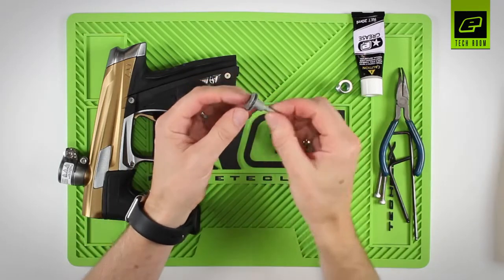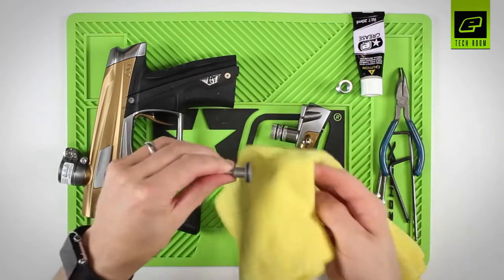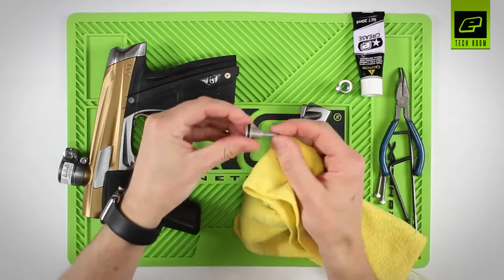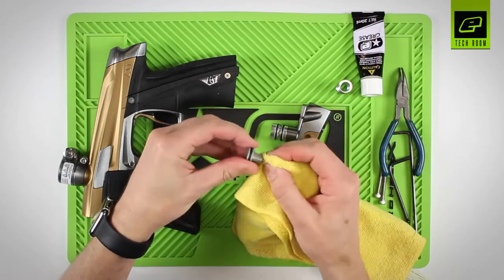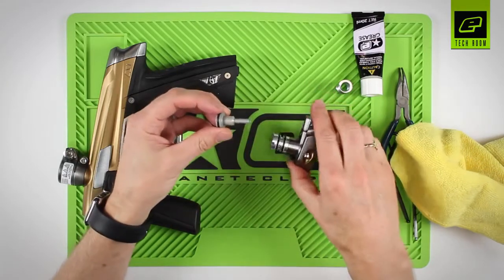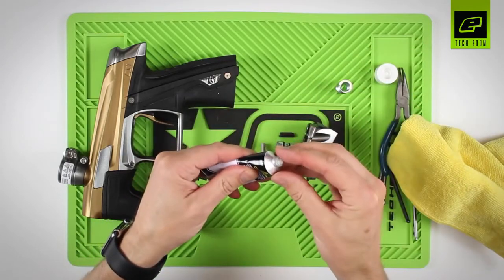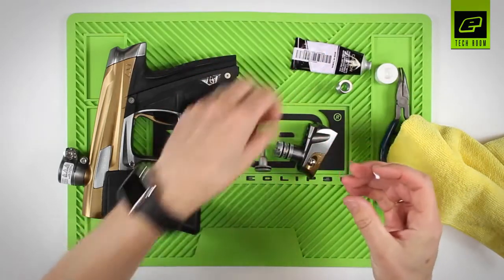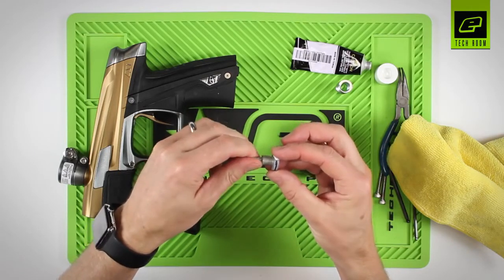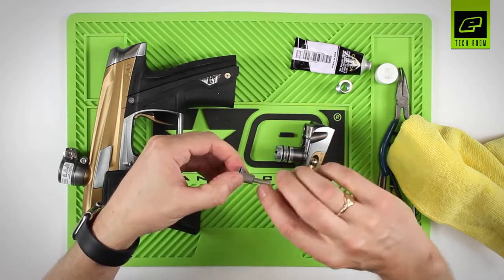On the piston there's one o-ring. This is a 14x2 o-ring. You can wipe this down. Also wipe the stem piston, as this seals around a number 8 o-ring that's inside this piece here. The piston can be lubricated with a small amount of grease around the main piston seal and a small amount around the stem.